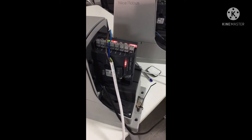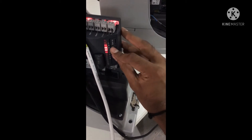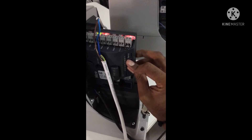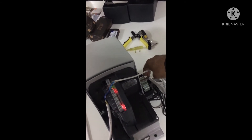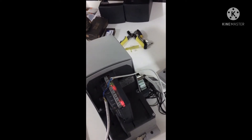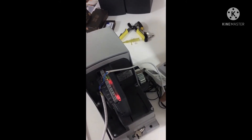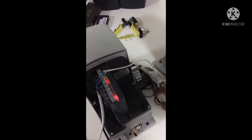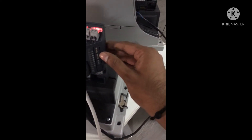In the blue bus search, the motor will search the photocells and other accessories connected to the blue bus terminal. Now LEDs L3 and L4 are blinking, so we will go to the position search — the motor will start closing. The programming of the master motor is now finished.